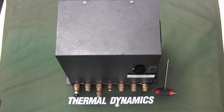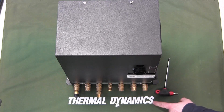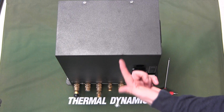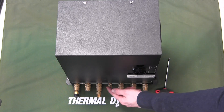Today we are going to check the insides of the DMC. The DMC takes care of setting the gas types after applying a process. You have the gas inlet ports in here and the outlet ports are at the other side, so gases enter from this side, then based on the process, the gases go out to the DPC from the other side.